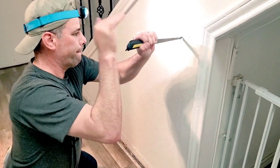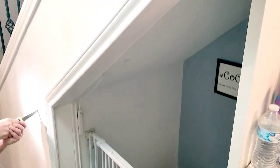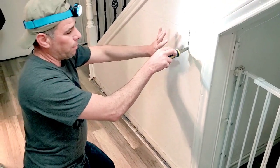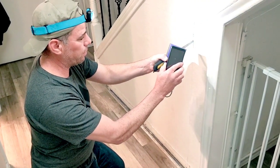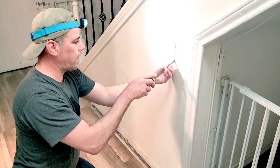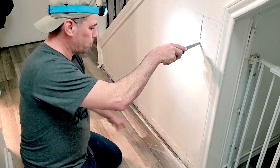I'm not an expert but I follow a lot of common sense. When cutting in the stairway area there's a lot of space. When cutting a regular wall, I always recommend going in just a little bit in case there's a wire or a PVC pipe. You can identify wires or pipes with a device, but I always recommend not going all the way through — use a small, solid motion to cut it down. Also good practice to have a trash can right here.